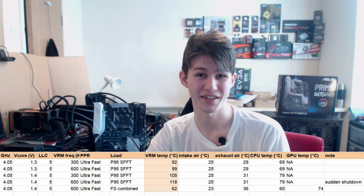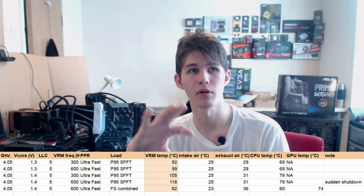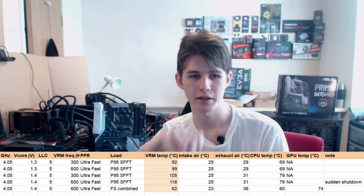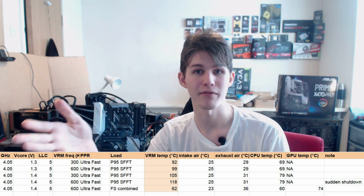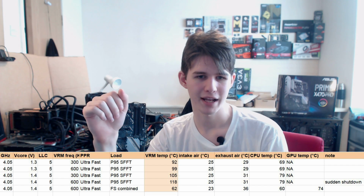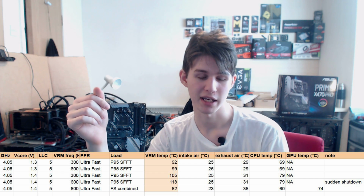Basically, if you're running a 2600X, your VRM temperatures will be even lower than that, because the 2700X at 1.3 volts should pull more power than a 2600X at 1.4. So if you have a 2600X, this motherboard should have no issues whatsoever. If you're going for a 2700X, it kind of depends on your ambient air temperature, really.